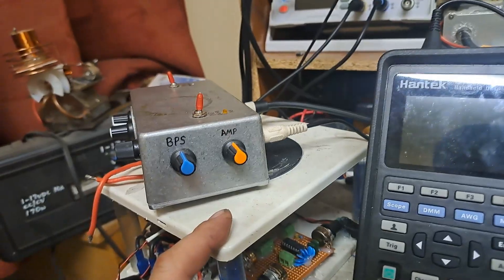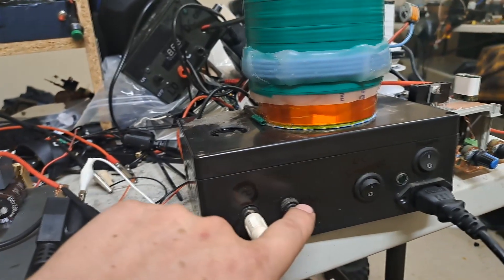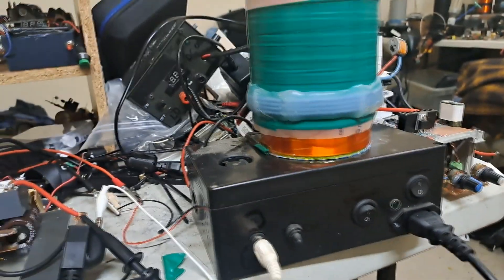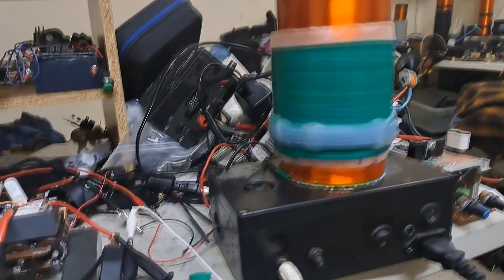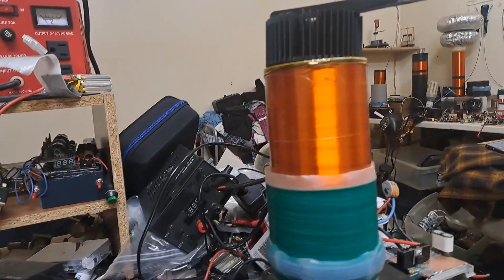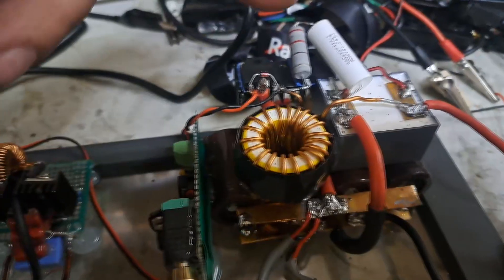For testing I'm actually using this guy here. I've got interrupted CW, and I've also got a switch to take the DC smoothing off. Taking the DC smoothing off, I should be able to use this as sort of a test deal — probably not going to be amazing ramps or anything, but I'm just trying to see if this will work out.